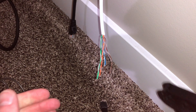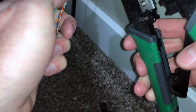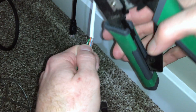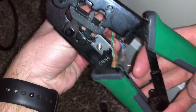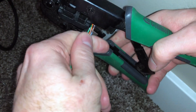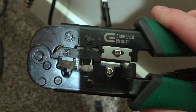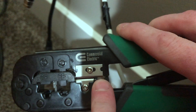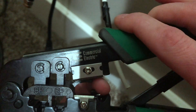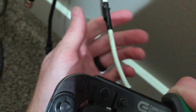I'm in a tight space but I'll try to get this on video. On the crimper tool, you'll see you have the ability to snap or cut a line, and also strip part of the wire. I'm going to run this through the little hole here and cut off the extra wires. The razor blade on one side is a little longer, and there's also another section that scores around the line. We'll put the wire in, cut and rotate around it, then pull off the sheathing.